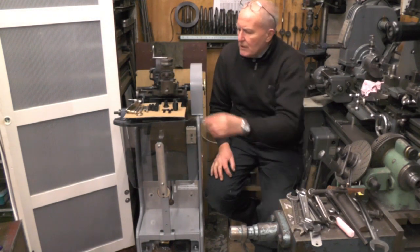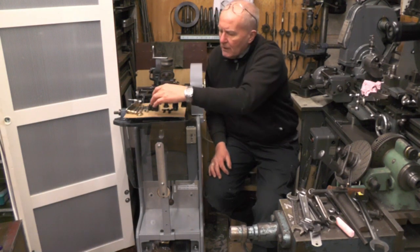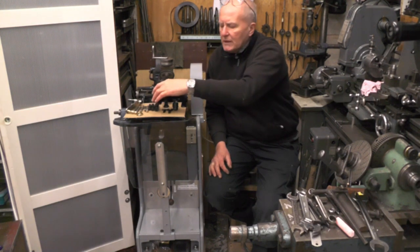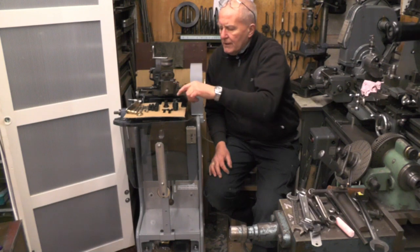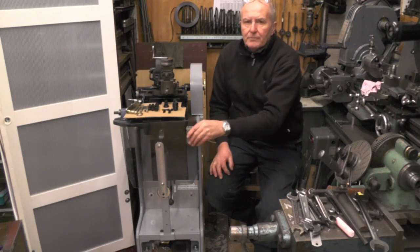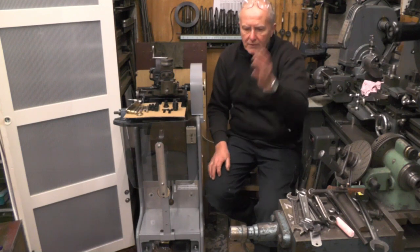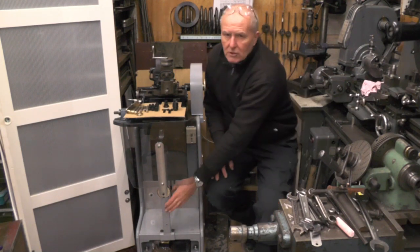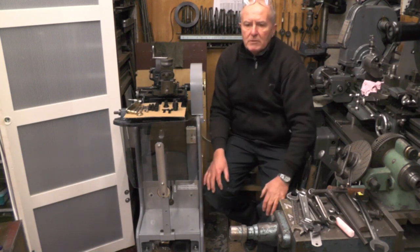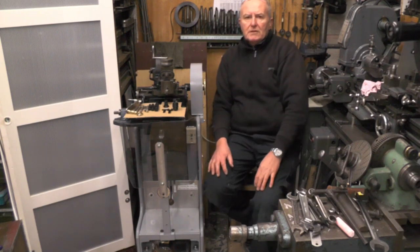So what I've been doing is I've been busy making a few sets of basic tooling for it and some various other things. I've got a basic set of tools, I've ground up a few adapters, a slotting tool for doing keyways, and an indexable tool holder — I'll show you them in a minute. I've also made a chip guard which I can put in any position to stop chips flying everywhere in my workshop, and I've made a leg support for under the table which is adjustable.